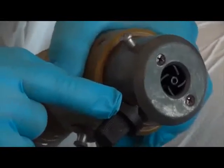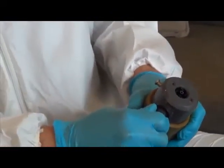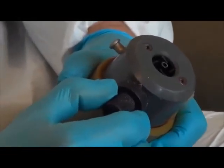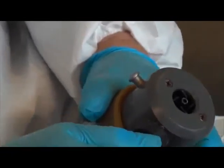To adjust the spray for the micro-mist fogging machine, start with the knob at the end of the hose in the off position. When turning the knob to the off position, do not turn past the point where it stops because the screw threads will get stripped.